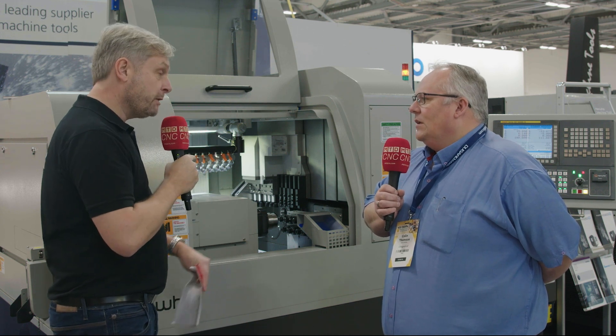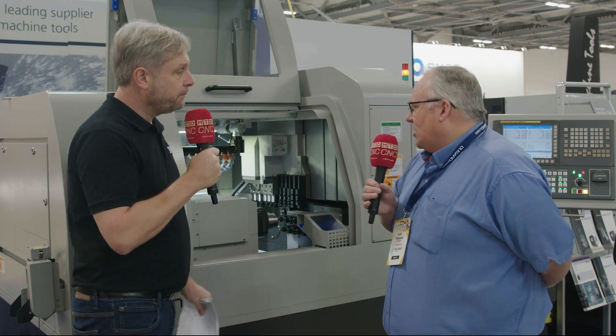What about size of the machines? This actual machine is a 38mm machine — it's called an XD38R — and it can take 40mm bar without any bar preparation or any adjustment to the machine. From the range of the Hanwha machines, we start at 3mm diameter and end up at 45mm diameter, so it's a big range.